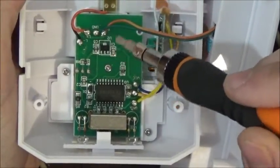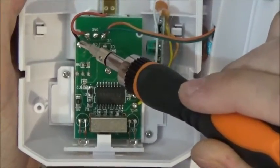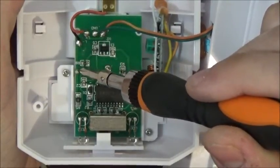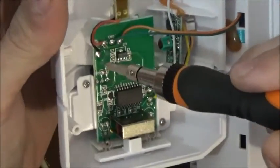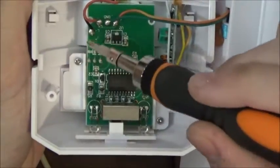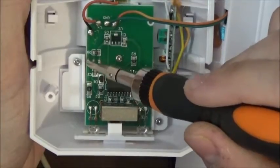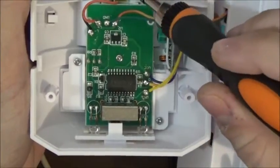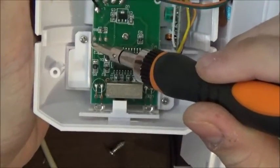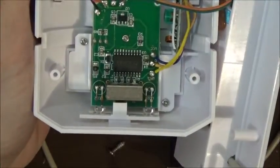And I see that the main LEDs connect right here. And if you follow this line right here, it goes to this. And when I turn it to the side, because there's something underneath there, it's a capacitor. So it goes to a capacitor. And this could be to just filter out stuff, or maybe it needs an instant burst of energy when it first turns on. Then it keeps on going. If you keep following it, it keeps going, and bam, that is a surface mount resistor.